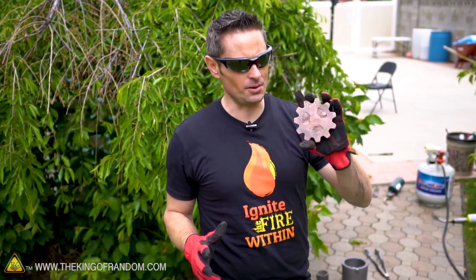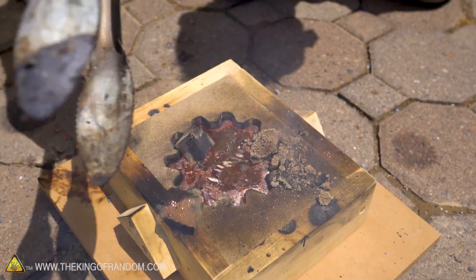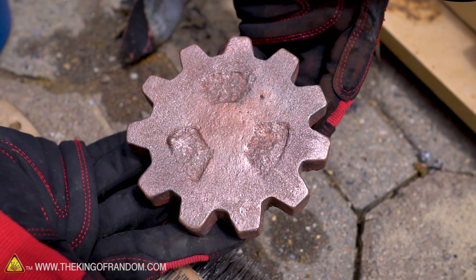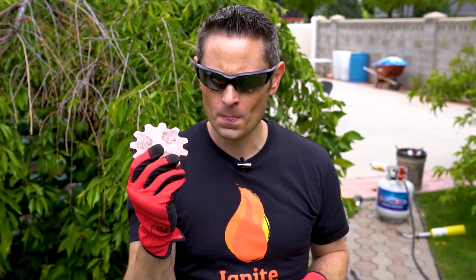Well guys, I feel like that took way, way longer than I ever wanted it to take. And after six attempts, I'm starting to lose confidence that casting copper in green sand is even a viable idea at all. I've never actually seen anybody else do it, and that's why I wanted to try it for myself. But it seems the two problems we keep running into are either the copper cools down too quickly to form a nice mold, or it destroys the sand and breaks up all the details. In either case, it was worth a shot and we learned something about the process. And now I've got a $60 copper paperweight I can go throw on my shelf. If you've ever tried green sand casting with copper and had success with intricate molds, leave your comments down below — I'd love to connect with you and see how to get this to work. Until the next video, thanks for joining me for this experiment. Just a random thought — we could probably drill these pieces out and clean up with a file. That might work.